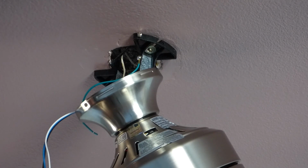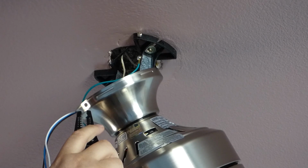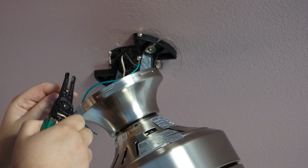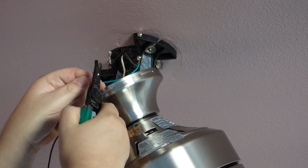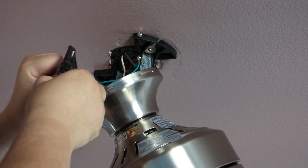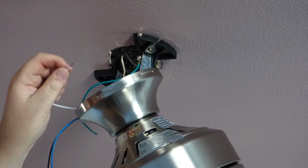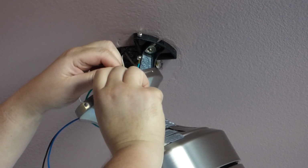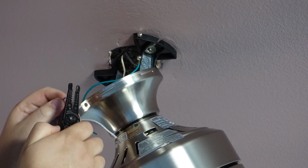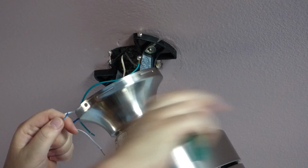Save that for later use. And then, of course, after you do that, you gotta strip them. This handy tool has strippers on it. And now the wire nuts they come with are like this here, little tiny things. So you don't have to strip a whole bunch of it. And you just kind of feed it through. The right gauge helps. It'll turn into pull. Maybe one more down. Turn and pull. There we go. Then what I can do, before I take these wires, you just kind of twist them. You twist these strands to be just solid. There. And continue. That's good.